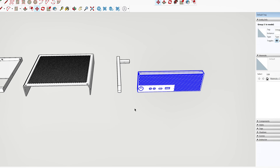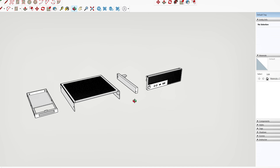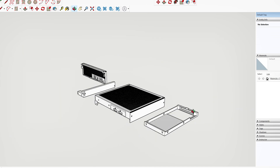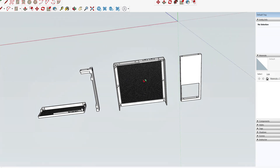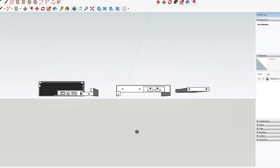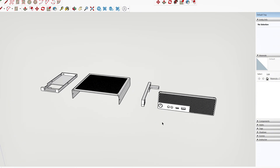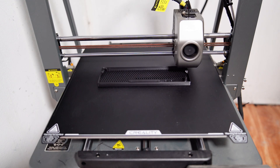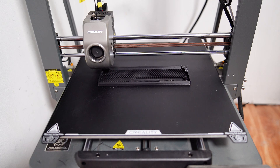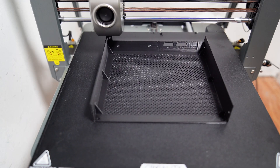The case is divided into two parts: a top cover and a front bezel. I designed a cutout I/O port for the RX 6500 GPU on the top cover, and I also designed a bracket to mount the PCIe riser adapter with the case, as well as the SSD and Pico PSU mounting bracket. I printed the case using PETG filament and the bracket using ABS. It took nearly 10 hours to print a full set of 3D case and bracket for this setup.